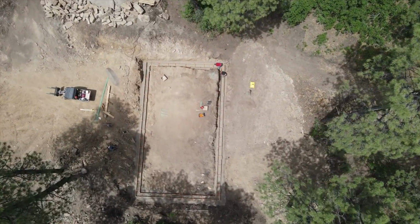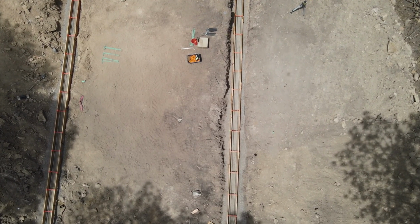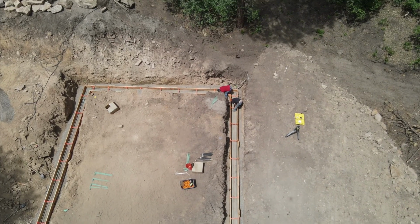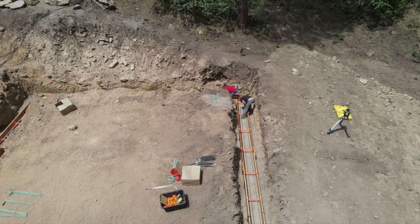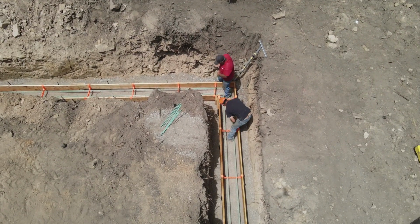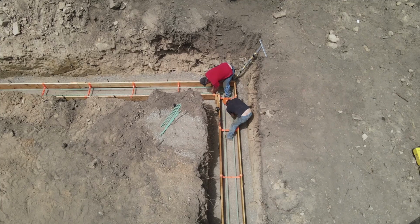It's going to be a nice peaceful place to work and store my equipment and stuff. Right there in the middle of the pad you can see the epoxy coated risers that I'll have, and those are called out on the plans every 4 feet, and we'll stab those in on the day of the pour.